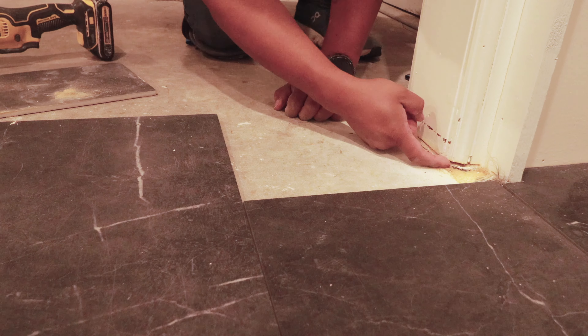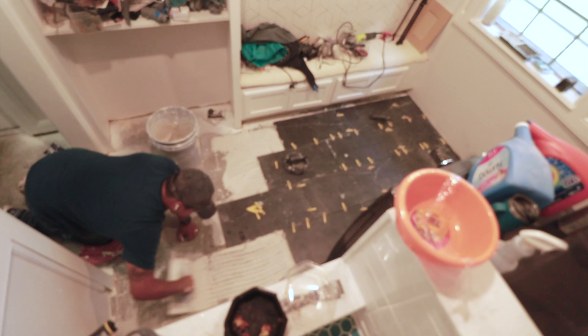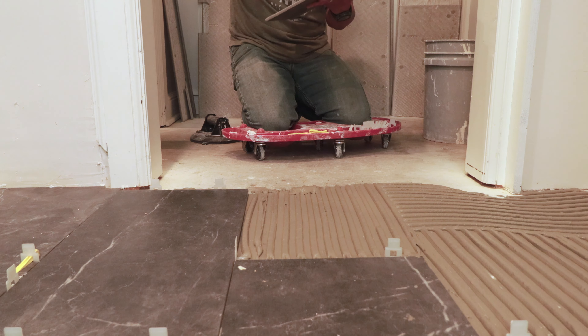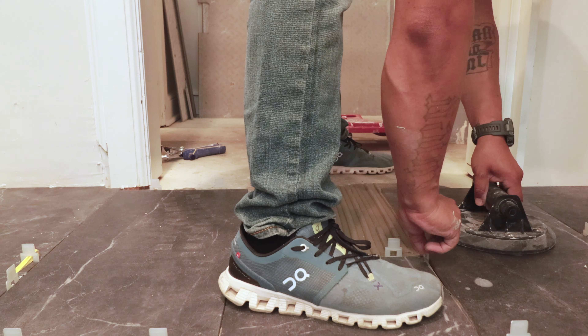The flooring was step by step — literally. I picked 12-by-24-inch tiles that match our front entry door area, the same ones I used in the entry just in a bigger size. I really like black tile for entries because it's easy to clean and tough when you come in with muddy boots and cleats. We started with a dry fit, cutting and fitting all the floor before applying the mortar, and did the undercuts on the doorway. I've been doing a lot of tile recently and upped my tile tools — I've got a handy knee roller and a suction cup tile holder that makes handling these bigger tiles so much easier.